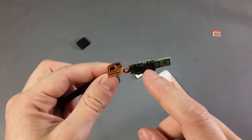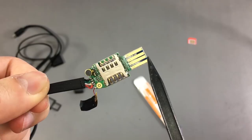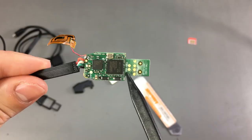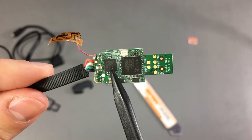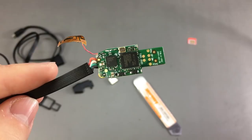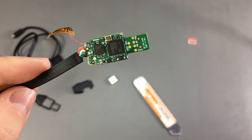The architecture is pretty simple. There's a pass-through connection for the USB data lines — the board does not interfere with them at all. There are two main chips: one is the MediaTek MT6261, a low-cost smartphone chipset that is rather closed-source and already fairly old, having been replaced with a newer model; the other is the RDA6626, a quad-band front-end chip designed specifically for low-end mobile phones or GSM modems. Other than these two you'll only find a couple of passives — it's basically the slimmest phone design you can get working, with the bare minimum. And here is the microphone that picks up the conversations.